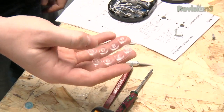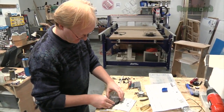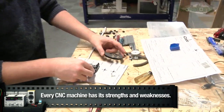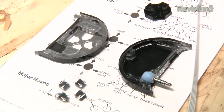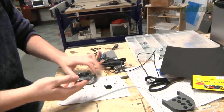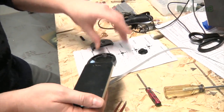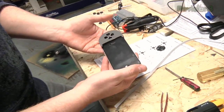I lasered some buttons, and now I'm actually able to put the Bluetooth codes on them too. I think these will work a lot better. The advantage here is we can use a thin piece of plastic for the backing — that way it's consistent and we know everything will fit. I'll get these painted and then start working on the other side of the unit, which will be the D-pad. Here are the parts for the D-pad section: the top shell, the bottom shell. The bottom shell has basically a dummy headphone jack in it just to give it some mechanical connection to the iPhone. We'll put the buttons in as well — basically it'll go in like this. That'll hold in right there.